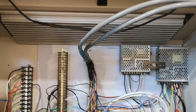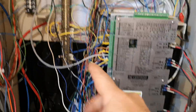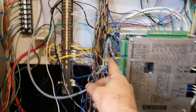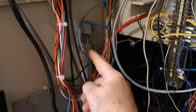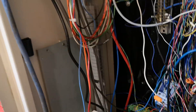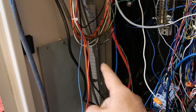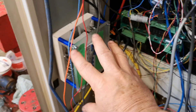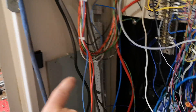All of these go over to the VFD and carousel for the tool changer, so that's a whole other mess — that might even be done last. I want to get a little bit of spacing here. I've got signal wires and power lines in the same trough right now, so I'm pulling that out and turning my breakers around.